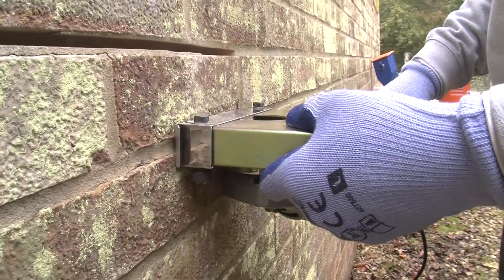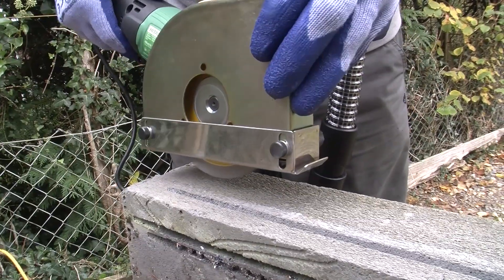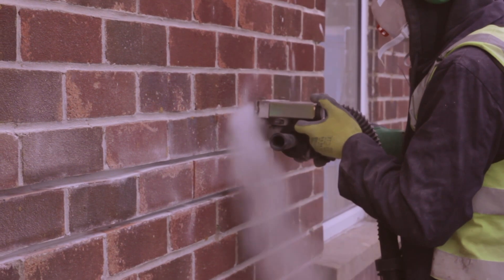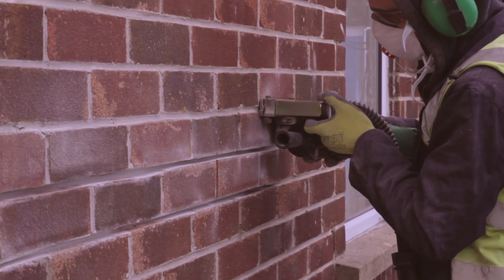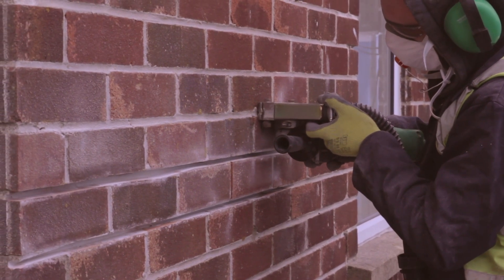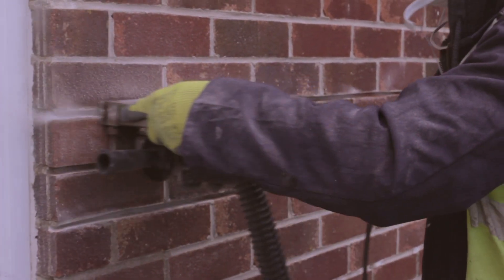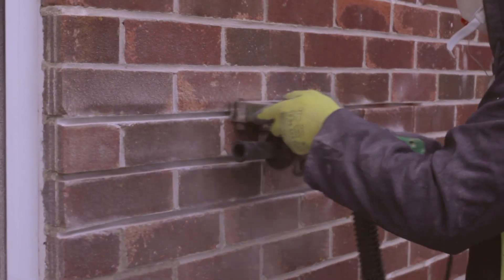When you've reached full depth, move forward. Plunging the blade into the cut is obviously not as clean. With the raking cowl above the grinder you work from right to left following the upturned edge. Using the correct width blade would probably have avoided this situation. Always try to rake the joint in a single pass.